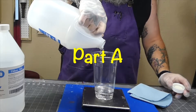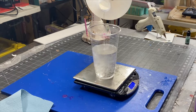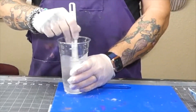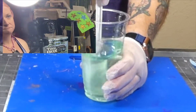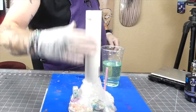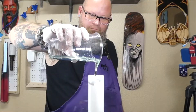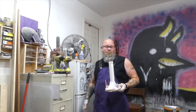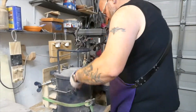I use a two-part urethane resin which is measured by weight, so you're going to need a scale to use this stuff. I do like to tint my masters because it helps me see if there's any chip-out or anything I need to address. And now my professional-grade master mold blank — just some PVC and a lot of hot melt glue — and then it's time to go into the pressure pot and then we have to wait.